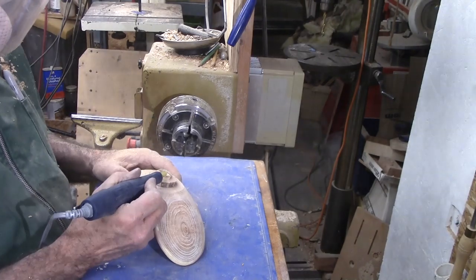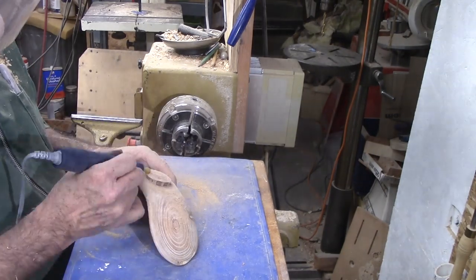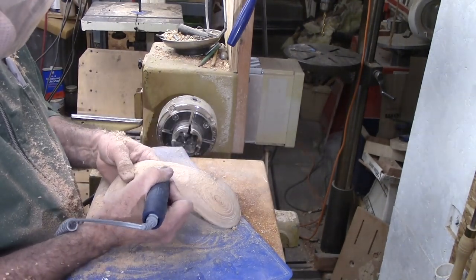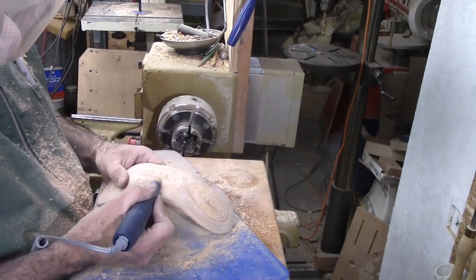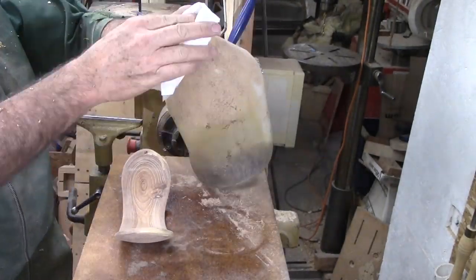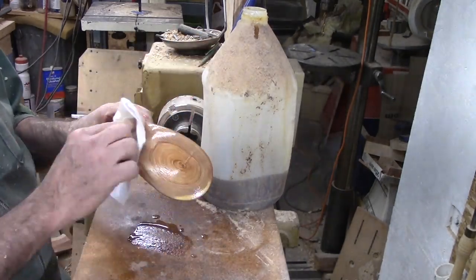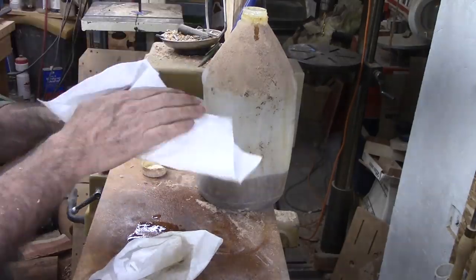There is no way I can reverse to turn the foot — well, there is a way, but why not carve it off for this one? I chose a likely oval-ish rasp bit and have at it. I am taking off the entire tenon, then sand the foot area again. After signing, I am giving this beautiful bowl a bath in walnut oil. Since it is green, it could warp — but who would notice? More particularly, who would care? Sometimes I like warp, sometimes I don't. This one will be a conversation starter: 'Is that a bowl? You turned that bowl? How?' This one is weird enough to be a great one.